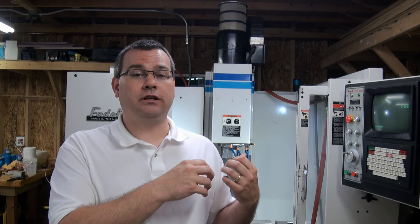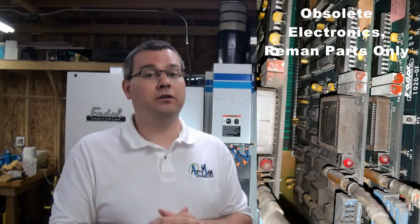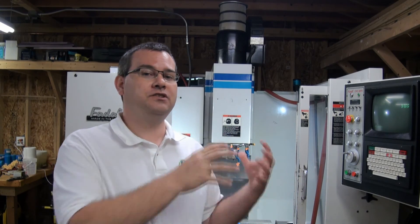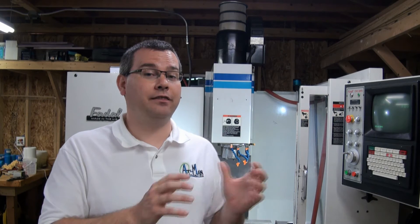Because this is an older machine — and we're comparing machines that have similar values, which means buying an older vertical machining center — you're going to have a lot more maintenance and might run into parts availability issues. When choosing a VMC, you want to make sure you can still get parts. This is a Fadal machine, and there are three or four websites where you can still purchase a lot of parts to repair it. You can't buy new parts for many things anymore, but you can buy refurbished parts — they made a lot of these machines, so there are plenty out there.